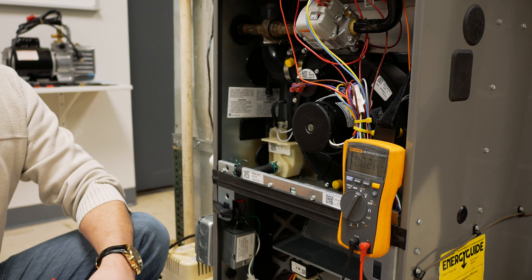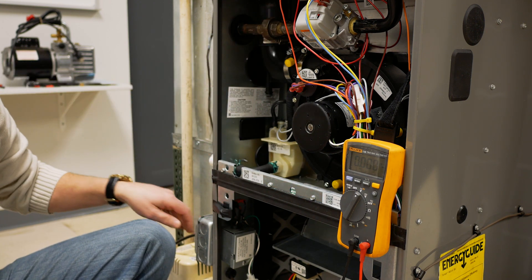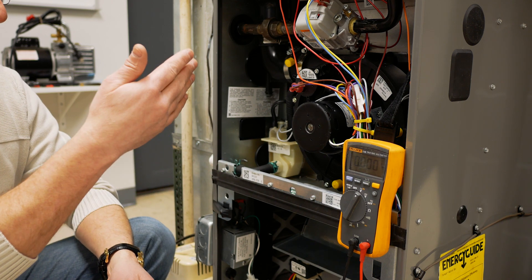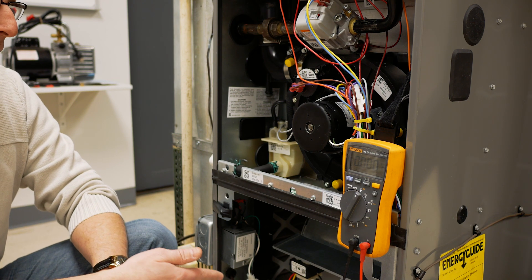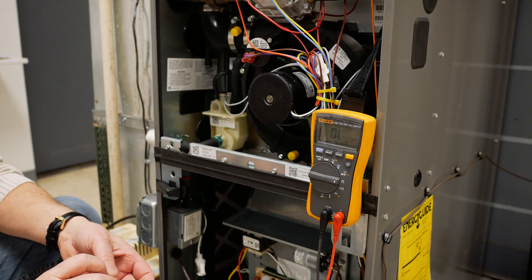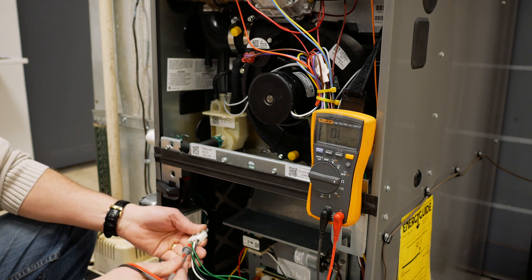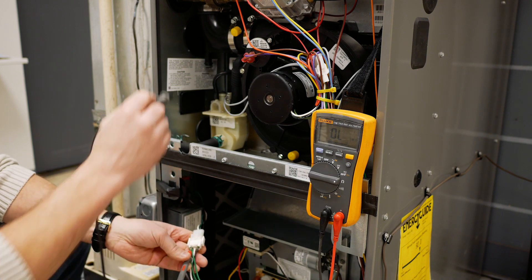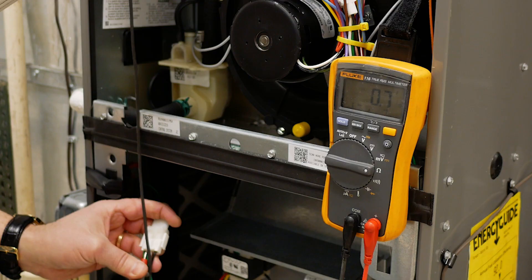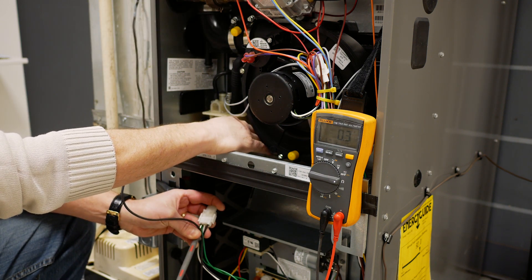When a flame is established, that AC voltage will push through the flame, creating a DC current. That DC current has to travel back through the chassis ground in order to get to the control board. One of the tests we want to do is check to make sure that we have an unobstructed — or no-resistance — chassis ground path back to the control board. To do that, we're going to shut power to the furnace off, put our meter on resistance, and check our leads. In this case, they zero out at 0.2. We then stick a probe into the grounding connector of the furnace, and in this case we get about 0.6 to 0.7 ohms of resistance coming back, which tells us we have a good electrical connection.